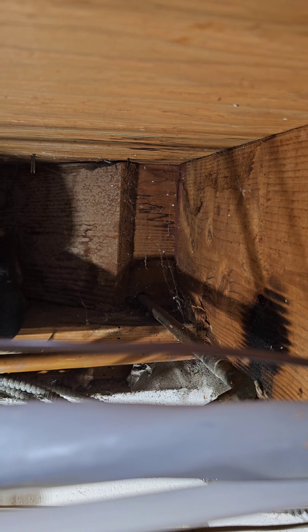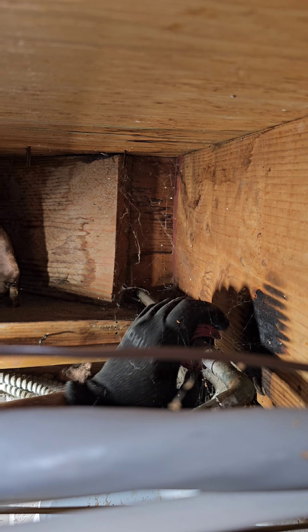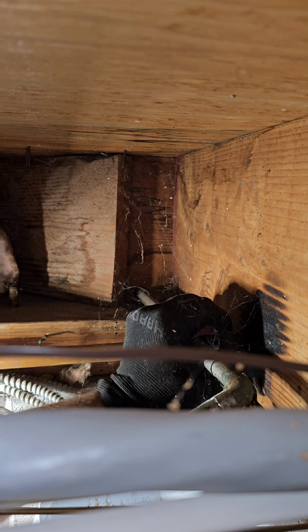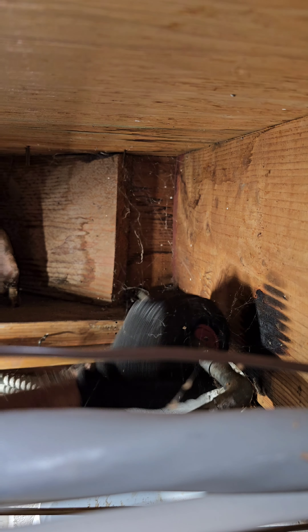As you can see, the spigot on top of the shelving unit they have here is going to be real tight. My guy's outside, I'm inside in this little cubby on top of the shelving units. I pull out the insulation and try to clear out the area as best I can - it's going to be a pain just to get in here. I pull out the Milwaukee auto cutter and start cutting the copper going to the spigot out front.